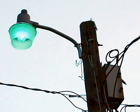Topic: Emission line spectrum. The strongest peaks of the emission line spectrum are: in low-pressure mercury vapor lamps, only the lines at 184 nanometers and 253 nanometers are present. Only the light at 253 nanometers is usable. Synthetic quartz can be used in the manufacturing to keep the 184 nanometer light from being absorbed.